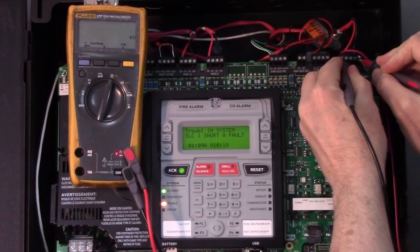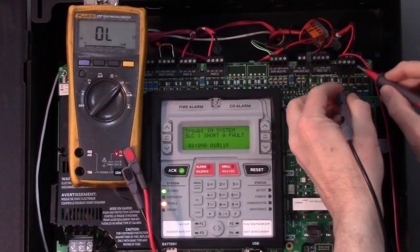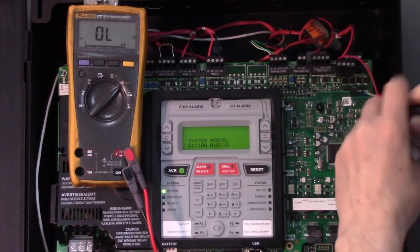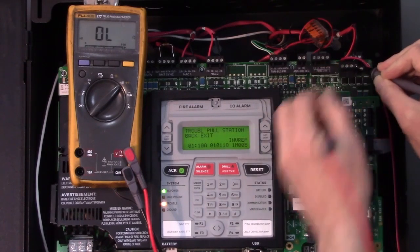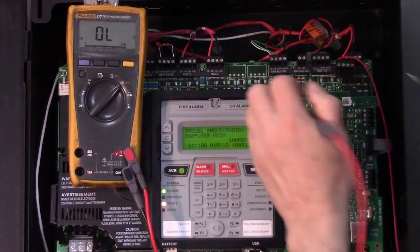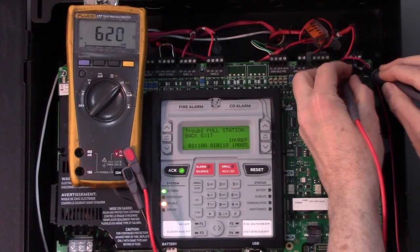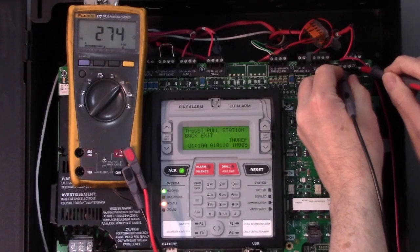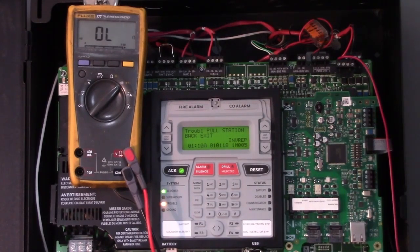It's not shorted. A better way to tell what's going on here is to use the diode check in this case. And you'll notice if you switch your leads around, you're obtaining a reading either way. So what we need to do now, we can make an assumption either something's wet, or more likely there's a device wired backwards. But the symptoms are very similar to both of those problems. So what we'll do is we'll take a look at how to isolate this issue.